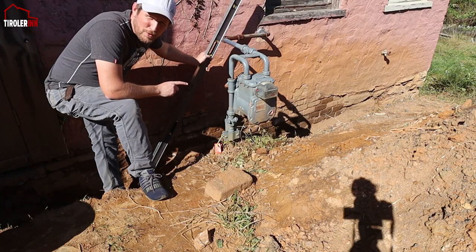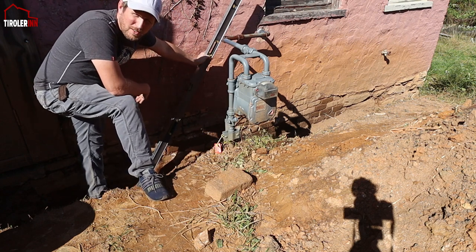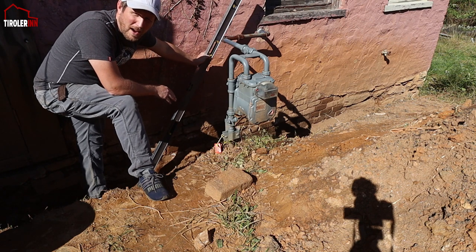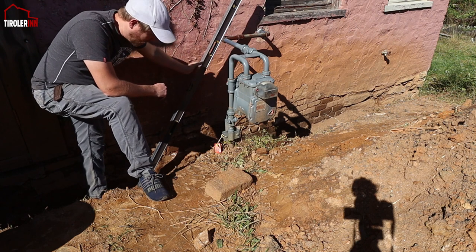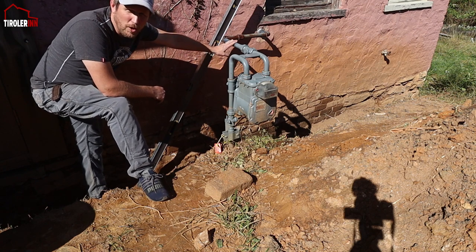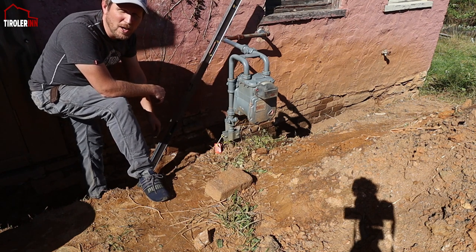So the next step is to start waterproofing the brick wall. I just cleaned it all up so that I can put a polymeric membrane on there, and then I also have some plastic waterproofing that is going to go over it. But first I want to figure out exactly where the level is so that I can waterproof that entire section, especially if we later use this as a driveway, so we'll have a more flat area. I want to waterproof it the entire way where I need to.